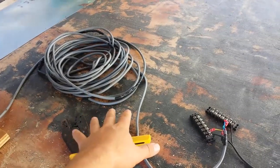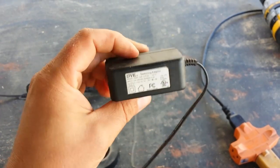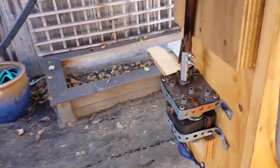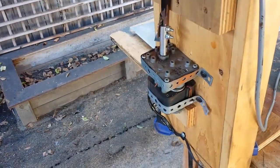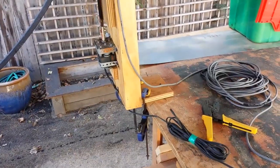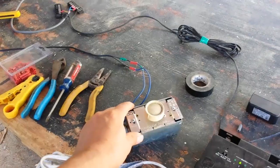People will be able to go, 'Oh wow, the weather vane moves!' We have plenty of cord that'll reach all the way down to the ground. I have it temporarily hooked up to a couple of terminal blocks. We have several of these little small power supplies — basically phone chargers — and you can run several of those modules off of one. As far as the motor goes, these are motors we got off McMaster-Carr a few years ago. This one is the same type of motor we use for our breathing grave. I'll put the information on it down in the description.